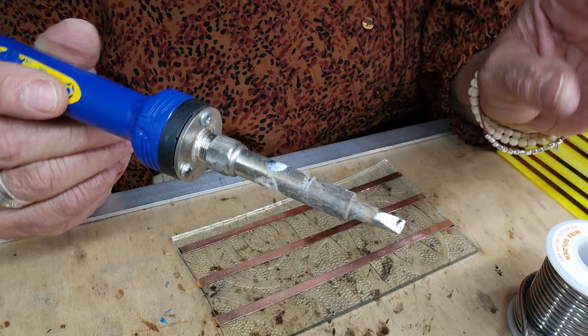So I'm going to show you what we're going to do. I'm going to just pour a little bit in my lid. I'm going to throw the flux brush out. Now I want to get a little bit of steel wool out. If you want real black lines, this is what we do. You're going to be able to see how this roughs it up too. Now watch how fast this turns black. Should only take a couple seconds to turn black — and that's exactly what it does. Just kind of goes boom. It's done. It's very black.